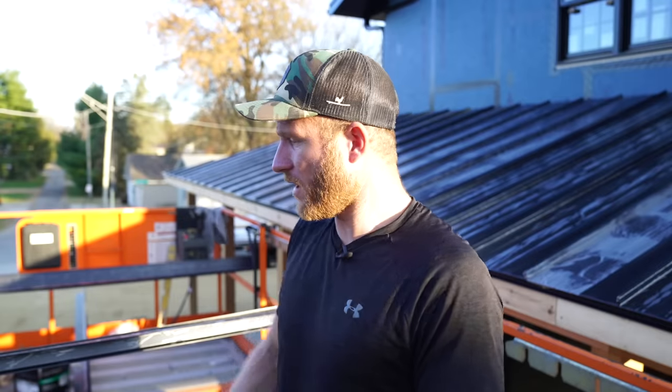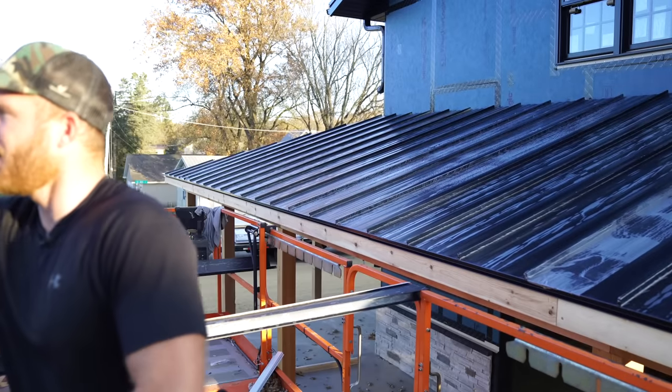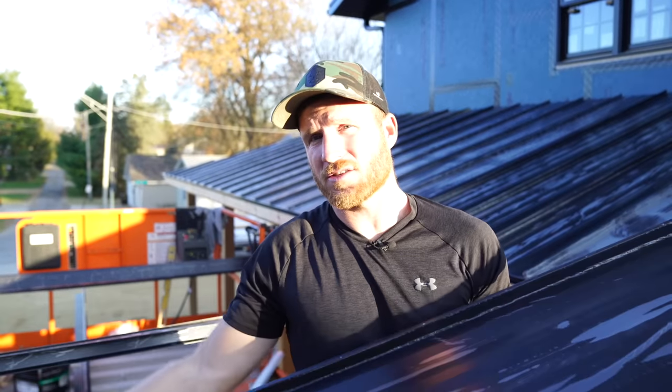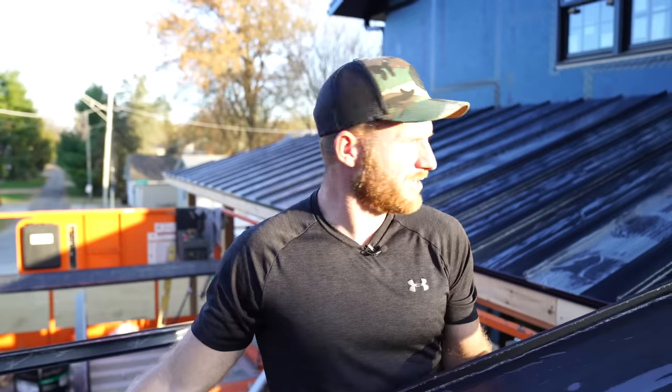Well, I'd say not a bad day. We were able to get around the bigger porch. So we've got the two porches, one of them being probably half the size of the other one. And Greg's giving me the last piece right now that we need for today. Hardest part's getting through the hip, making sure everything stays square. And I think we did a pretty good job because everything worked out dimension-wise. Now we gotta do a lot of trim details in order to finish this porch, such as our rake details on the ends of our gables, the hip cap, and our connection trim that goes along the building